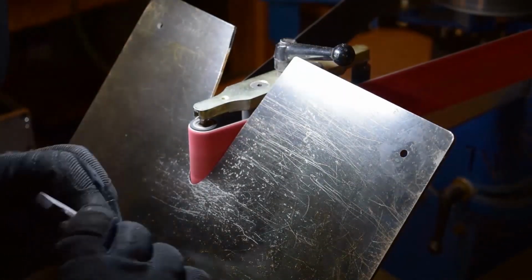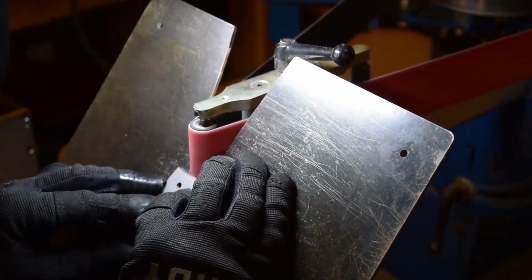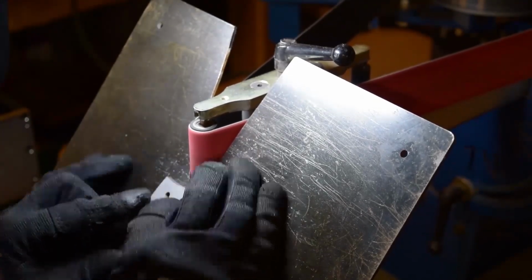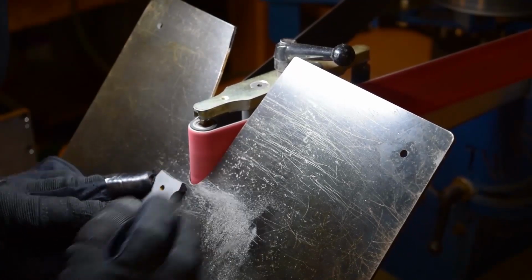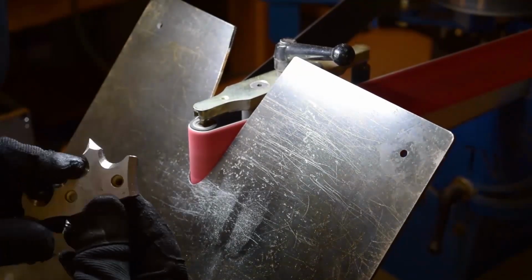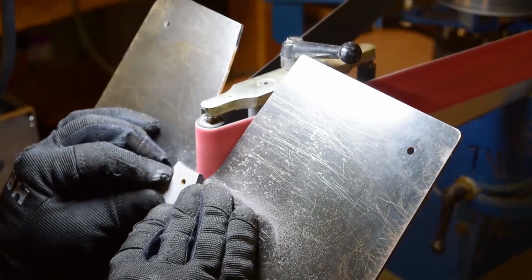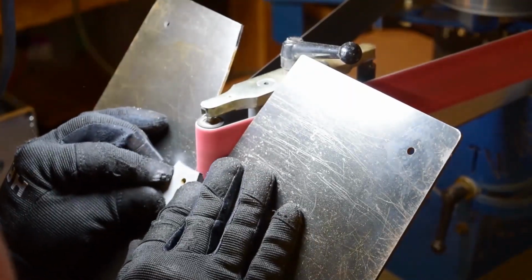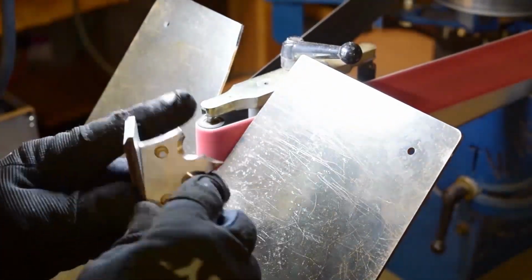All right, now this area here on the final part of the sword itself, it's almost like a thumb recess. These parts are recessed so that the blade essentially sticks out, kind of like a thumb rest. It has jimping on it for a little thumb grip, but it has a slight curve to it. So again, if you put it on the flat platen, you'll have a straight, cross side to side grind. But since it has that slight curve, I'm using the small wheel just to give it that curve, following the edge.